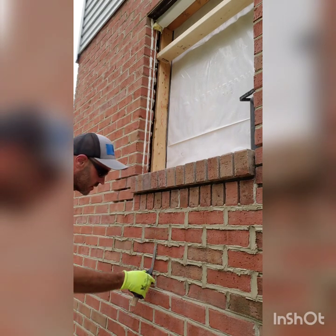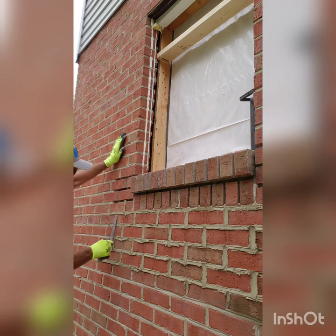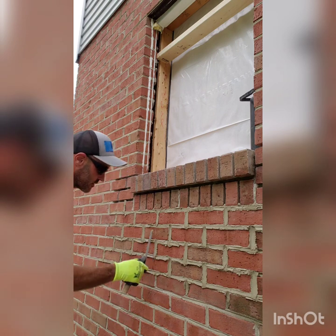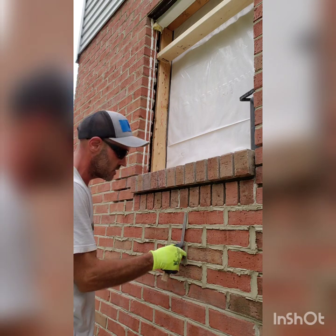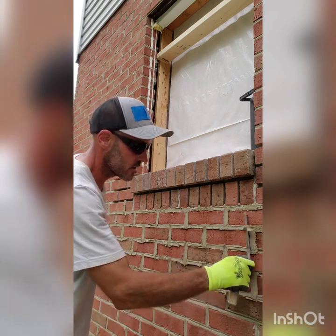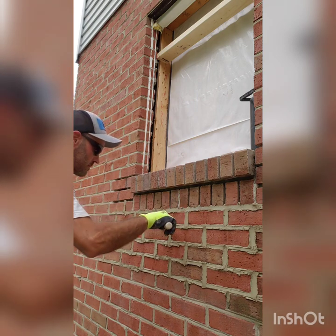When you come back with your acid it'll expose the sand granules in your mortar joints and make it not look so creamy. That's another good way to match historical stuff — I do that on almost every single job, unless the historical society I'm working for doesn't allow it. Like on the bridge right now over the Ohio River — we're not allowed to use any kind of chemicals because of the chance they can get into the water. The river's pretty nasty; there's a lot worse things in there than a little bit of chemicals.